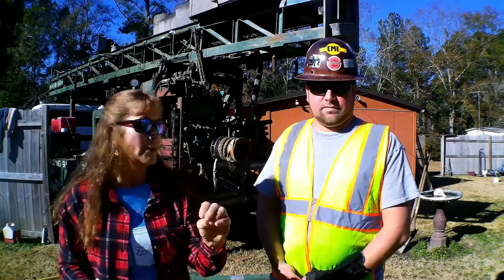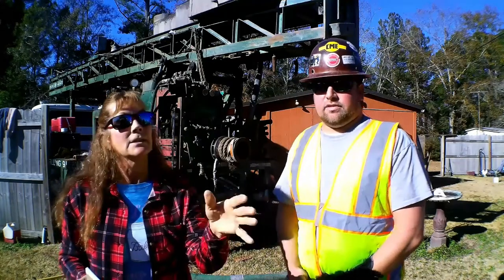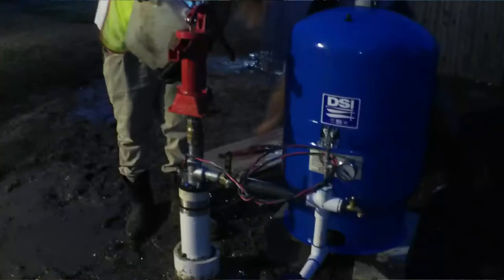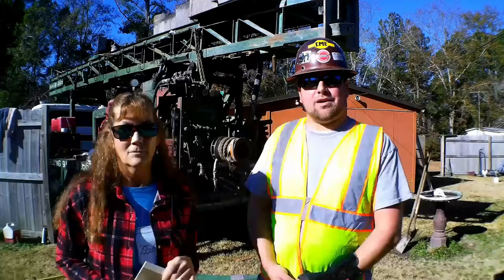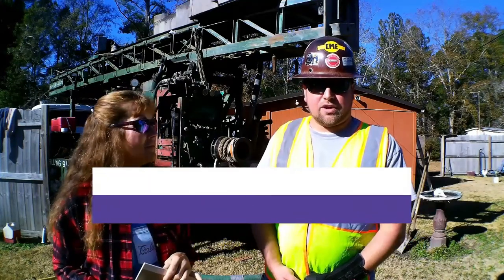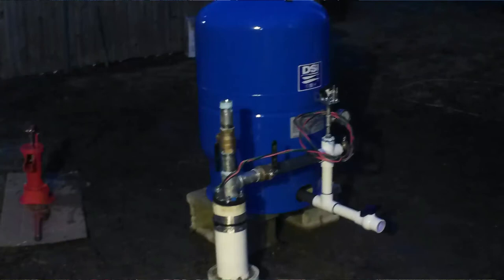This is not just drilling a well and putting a tank on, a pump, an electrical pump on there. And then he's also putting a hand pump. So off-grid, on-grid, no power, it's on. We're going to have a submersible pump, one horsepower, 25-gallon-per-minute Franklin Electric pump. And we're also going to rig up a Simmons pitcher pump on top where she will have the option to isolate if the power is off and be able to hopefully pull water with the hand pump.